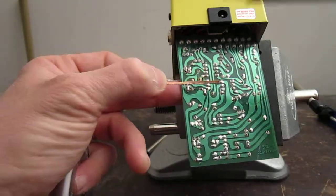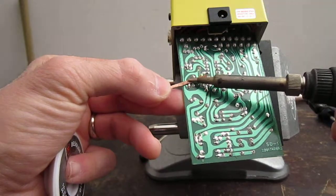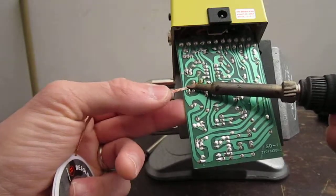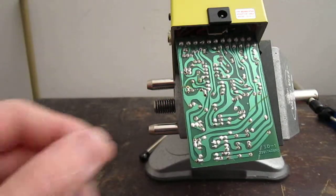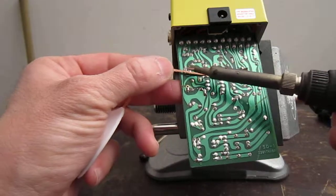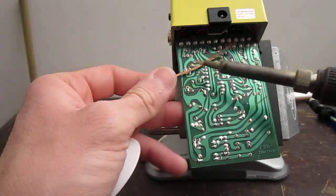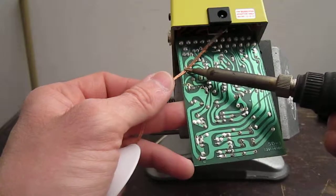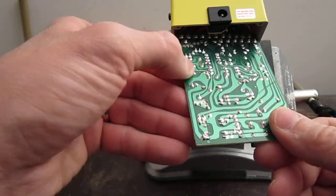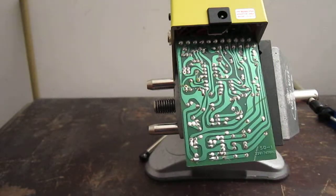and this is great for if you want a cleaner board, and after you remove the part, you just heat up the braid right on top of that pad, and then you just pull back on it, and it gets the board much cleaner. And sometimes it takes a couple tries to get it. And there you go. It takes most of that solder off very nicely.